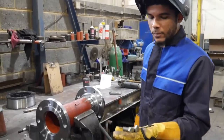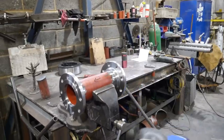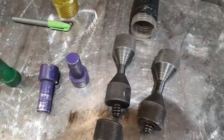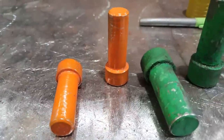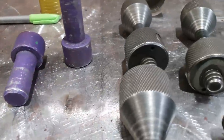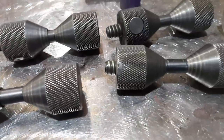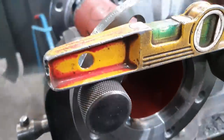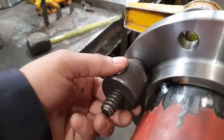I don't have flange pins so I use bolts - they work just as well, the checkers use bolts so there's no issue with it. I do actually have flange pins and some lathe-machined pieces, but the issue is some flanges come with different size bolt holes so they don't always fit. I always resort back to normal bolts. Flange pins take too long especially on small pieces - with bolts it takes me like two seconds to tack it together.